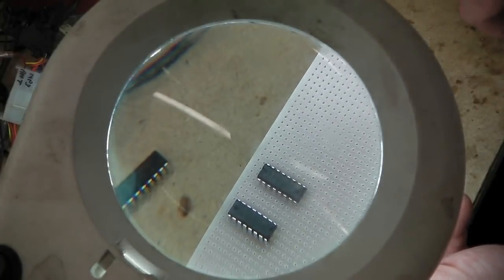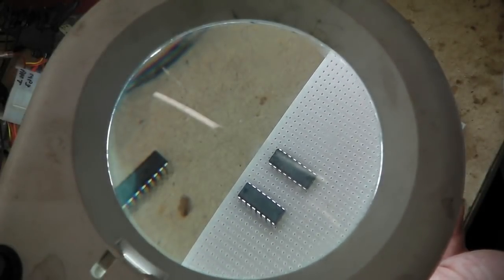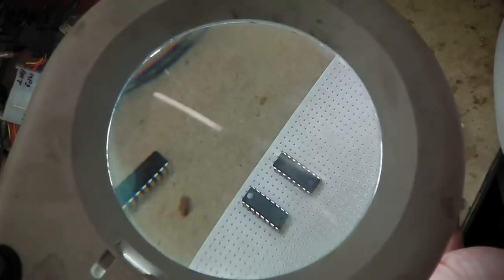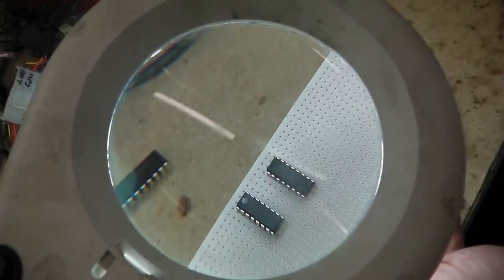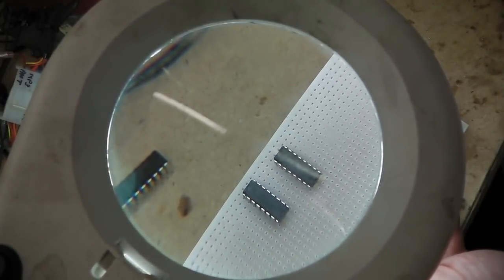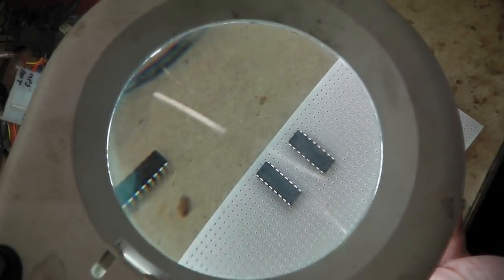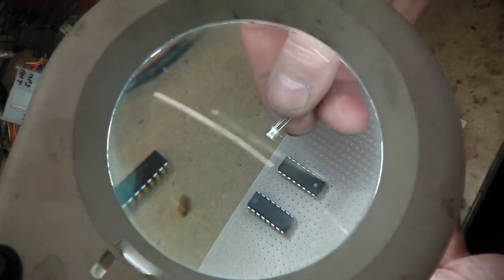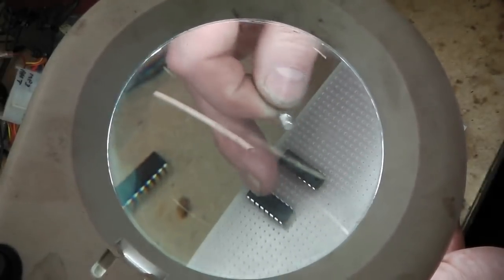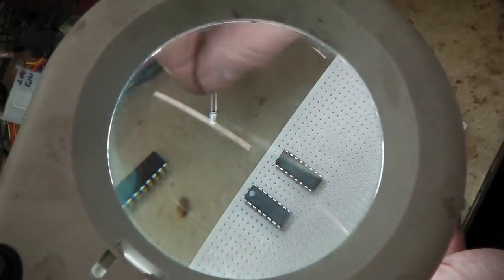I'll show you what I mean by a transistor. I'm just looking at my bench. There's different types. This one's a high power type. There's different current ratings of the transistors, similar to relays. Here we are, here's the normal ones. I call them a BC108, a nice tried and tested reliable transistor. It's your common and garden transistor, BC108, lovely little piece of kit. There it is. But there's 10 of them inside that bank, and the common pins are all linked up. Saves a lot of messing around, saves a lot of wiring. If you only needed one, you wouldn't put the whole chip in there. You could just use one transistor. But there's a bank of them.